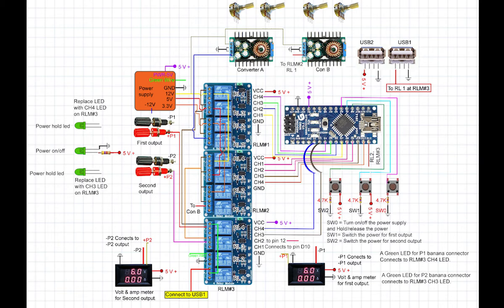For the step-down/step-up converters, we have two onboard potentiometers. We remove them and replace them with larger external potentiometers that will be mounted on the power supply cover. We do the wiring with three wires to each potentiometer from the top. One potentiometer controls the output voltage from 1 to 12V, and the other is likely used for constant current or constant voltage adjustment. The same wiring applies to both converters.